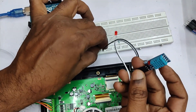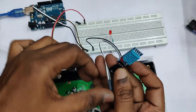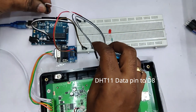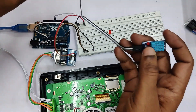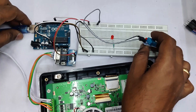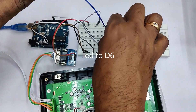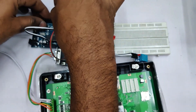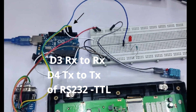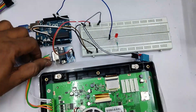We have connected the Arduino to a breadboard with the 5 volt rail and ground brought out. We'll be using DHT11 to measure humidity and temperature — ground is connected to ground and supply to 5 volt. The data pin is connected to D8 of Arduino. We also have an LED — its long terminal is connected to D6. This demonstrates the switch on/off from the DWIN display. The connection from Arduino to RS232-to-TTL is also straight: D3 to RX, and TX to TX. Now the connections are ready.